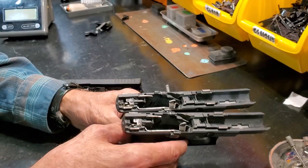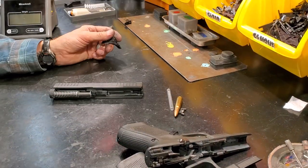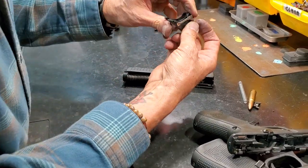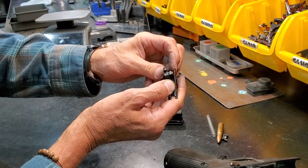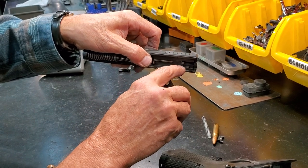At the same time, I have videos on transfer bar drag that talk about what I talked about earlier. If you have a connector that is hanging way out here in left field, way out like that, that means this hand or dog ear, whatever you want to call it, is going to be putting more pressure on the slide on this outcropping.